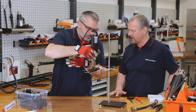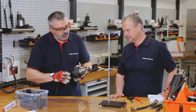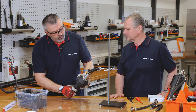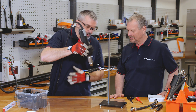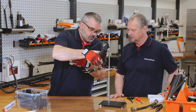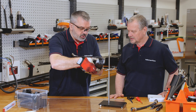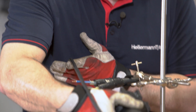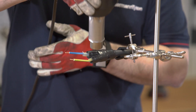It's starting to recover now — I can see it's changing shape. What do you mean by recovering? When we manufacture the product it's in a certain form, and within the factory we then reheat them and stretch or expand them into the supplied form. Once that becomes fluid it will run and seal up the end of the cable, creating the environmental seal that we're looking for for our customers.